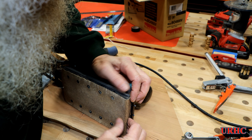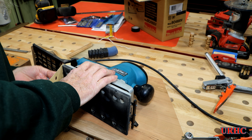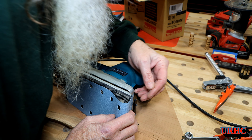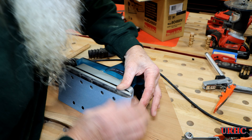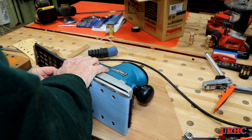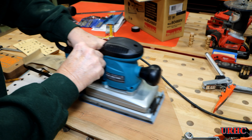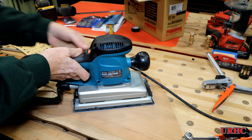I'm going to change it out — you can see the three little pins in the end that lock the paper so it holds nice and tight. Really happy with the way the clamps work, how they pull it in and hold it. Having a half-sheet sander here you're going to get a real flat area when you're done, especially if you keep moving it nice and evenly. My other sanders — the six-inch disc sander and belt sander — can really make an area dip down very easily, so this should help me get a nice flat tabletop.